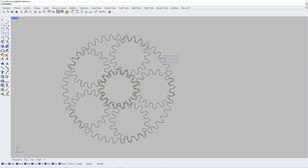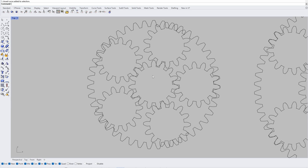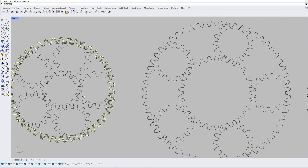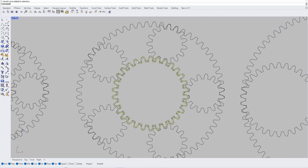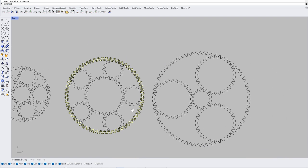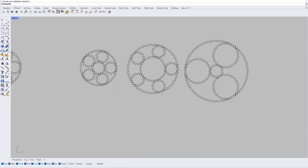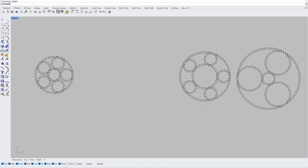With a Sun gear of 15 teeth and planetary gears of 14 teeth, the ring gear doesn't mesh correctly — the ring has to come to a certain diameter and the teeth must have a specific profile, so there are rules you have to factor in. Factorization yields 30 teeth and 15 teeth, which works well and meshes to a ring gear. The opposite is also true with an even larger ring gear: a smaller Sun gear of 15 teeth and planetary gears of 30 teeth, but that only fits three planets with a big gap — not what I'm after.